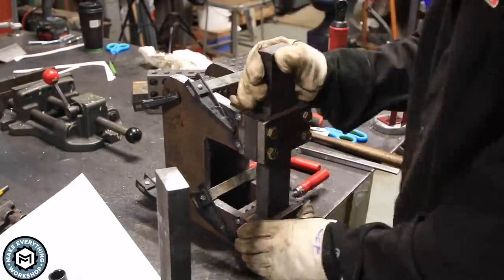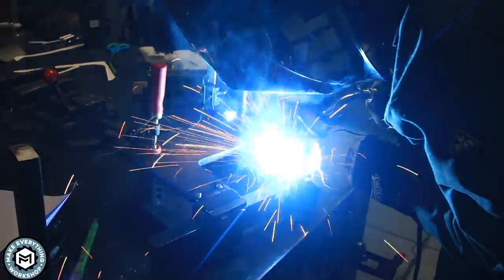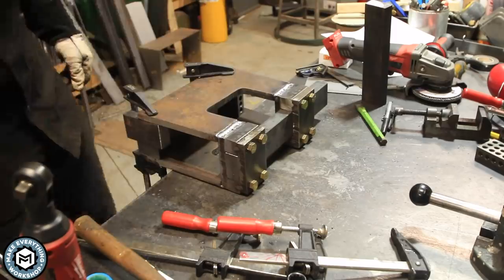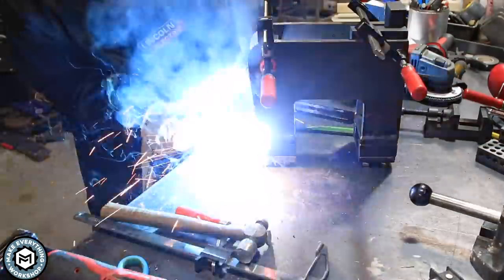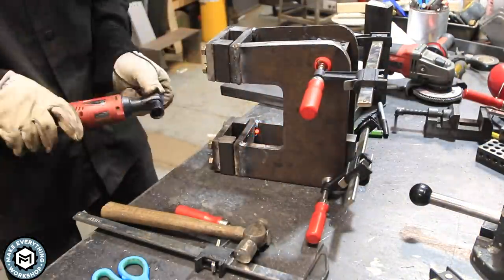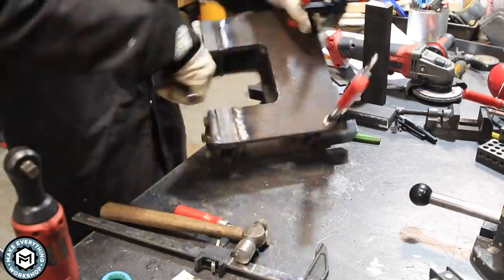I got a little jammed up — I thought maybe I had warped the plate because I couldn't get the tooling out. Turns out I just had a little bit of weld spatter, so I had to force my way to get it out. I'm able to go back and finish-weld everything using a Lincoln Power MIG 360MP — a large multi-process machine from Lincoln Electric. It has absolutely no problem welding half-inch material to one-inch material. It does MIG, TIG, and stick and it's a 360-amp machine. I highly recommend it — I'll put links in the description.